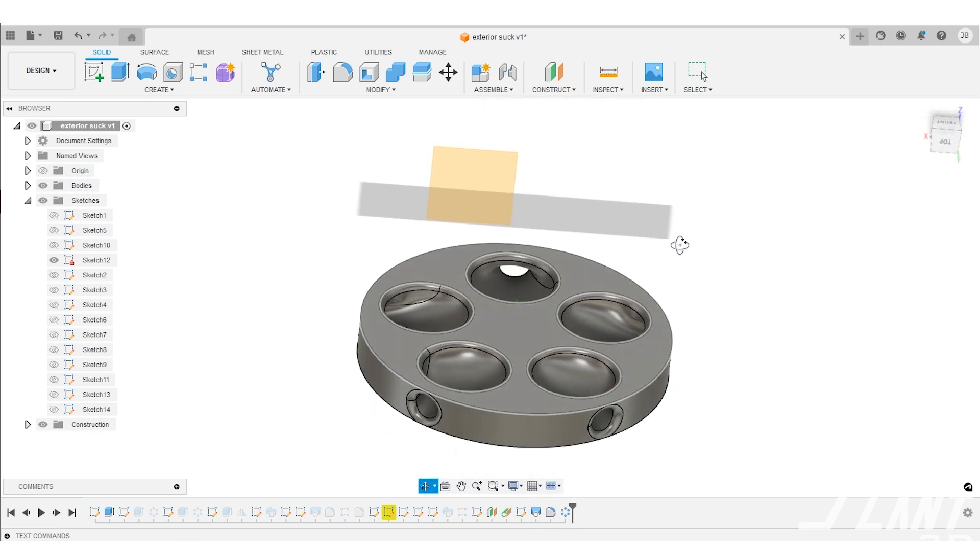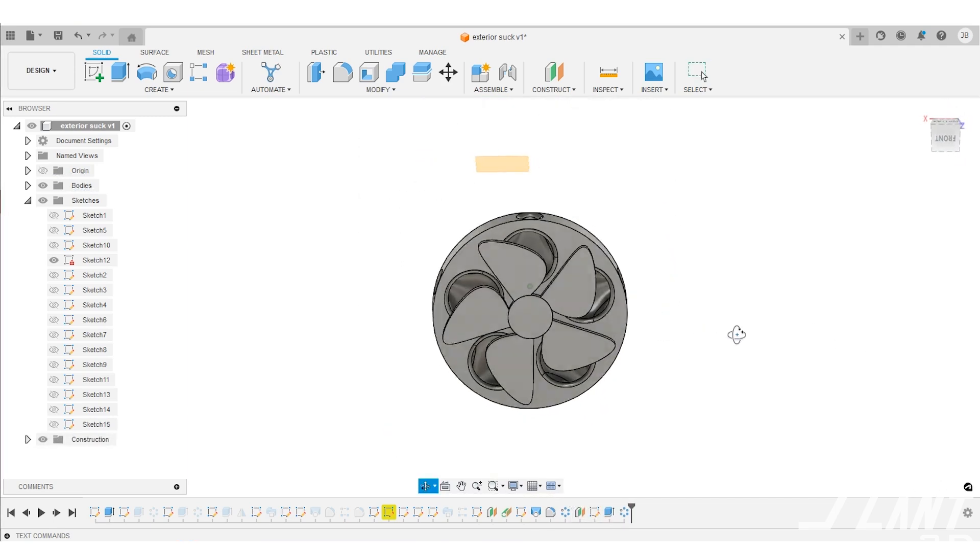Here's an example: a round plate where the fan mounts on top, but the intake or exhaust holes are along the outer diameter, so air comes in through the face and shoots out sideways. You always need to engineer your airflow appropriately, but this geometry is really difficult to achieve any other way, and you get it for free with 3D printing. You could also re-engineer this using copper or thermally conductive filament, mounting the design directly on whatever you're trying to exchange heat with — fan on top, airflow going out sideways, with grid patterns creating high surface contact area for excellent heat exchange. This turns a simple fan duct into a functional heat exchanger.